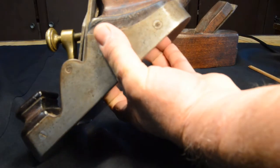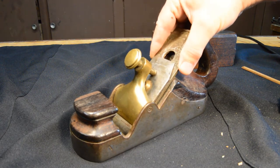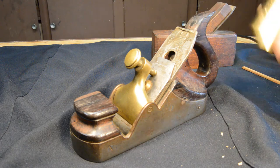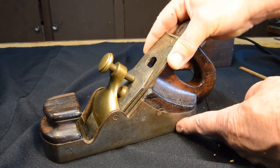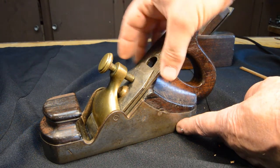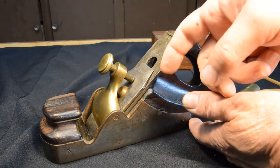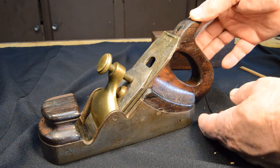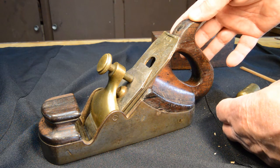One final comment on the comparison: with a wooden plane, you adjust the depth of the cutter by tapping the back or tapping the blade and wedge. Some people scoff at this, but that's actually a perfectly good, nicely sensitive way to set the depth on a wooden plane — quite usable. People generally don't appreciate that until they actually start using wooden planes. In contrast, with the Scottish infill smoother, you are not going to be hammering the back of this anywhere. You basically just move the iron up and down. You can see this one has mushroomed on the top — someone has been hammering on it too much. If someone out there knows a better procedure, please leave a comment below.